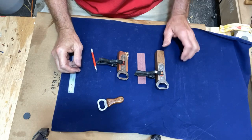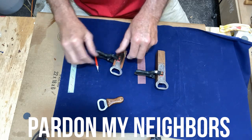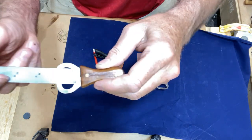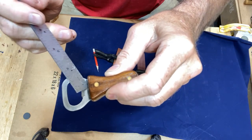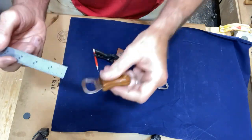Let me show you where I'm at right now. I've already traced the outline of both the African teak and the koa wood to the handle. I like to place the handle at three eighths of an inch relative to the bottle opener — the distance between the end of the claw and the handle should be three eighths of an inch. This will allow plenty of room for the bottle opener and the bottle to work together to open.